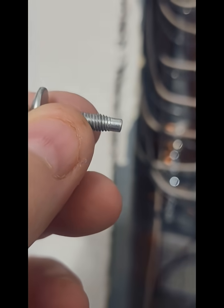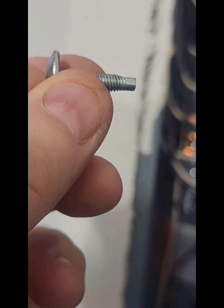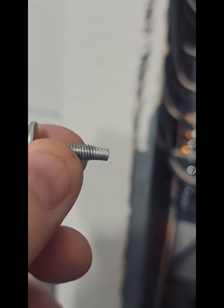Please don't go replacing them with pointy screws, screws that have drill points on the end, or drywall screws, because you could actually puncture a wire. That's it for now. See ya. Thank you.